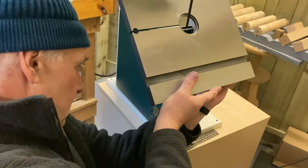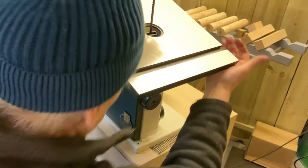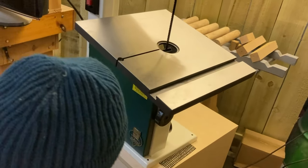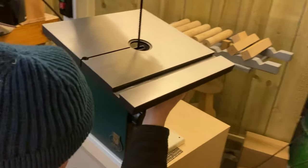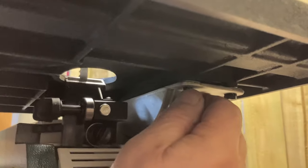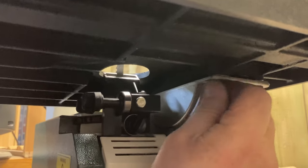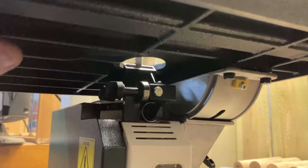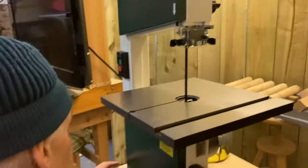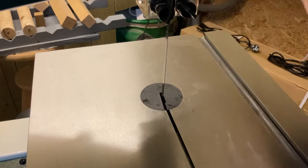Here's Indy — she's come to help me again. Just the last nut into here. It might be easier if I just lift it up a little bit — getting your hand in from this side is better on an angle. Make sure it's not cross-threaded. If it turns in by hand easily like that, you know you haven't got it cross-threaded. I'm just going to pop the blade guide in there now, and then I can nip them all up — not forgetting the nut and bolt on the underside of the bed.